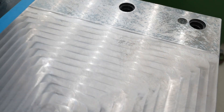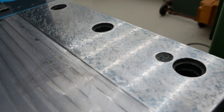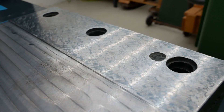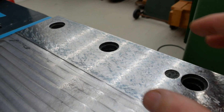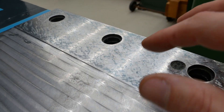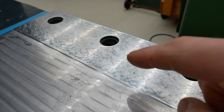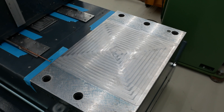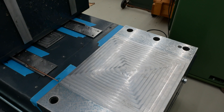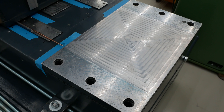On the other surface, you maybe can't really see the blue clearly, but there are two stripes at the edges where blue points are visible, and some in the middle but way fewer — so this surface is concave in the middle. But it shouldn't take too long to scrape these surfaces in to get a good bearing, so let's go.